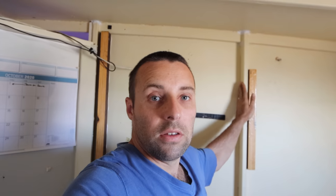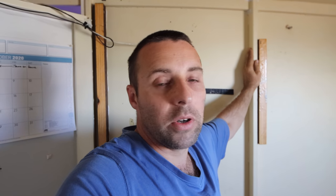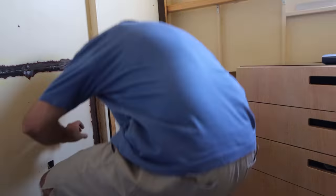That's pretty much how they're building boats these days, using flat bar as opposed to box. There's way less inherent rust issues with flat bar, much easier to maintain over time, and no downsides. It's just as good as using the box section. This box section is 2.4mm thick wall, so by using a piece of 50 by 6, you've got the same amount of steel holding the structure up.